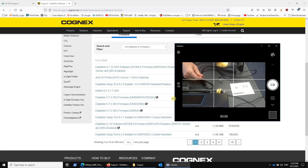We have this Y cable that is going to connect from here, and then the power will go into here. As we plug it into the PC, we'll see a USB driver that is part of the software install. That driver will then recognize this hardware connection as a USB to Ethernet adapter. And that's what this driver can conflict with some other software — specifically, if you're doing laser markers, the laser software from Epilog has been known to cause some issues.